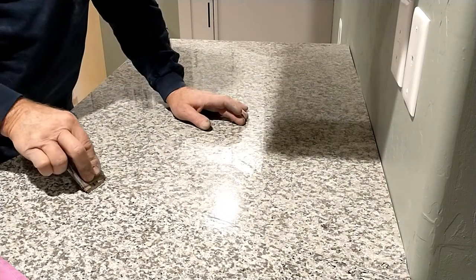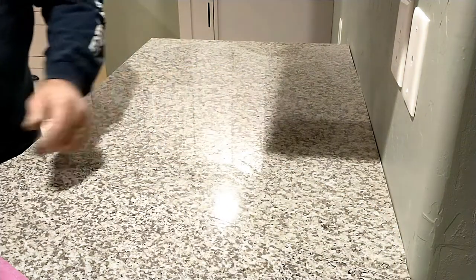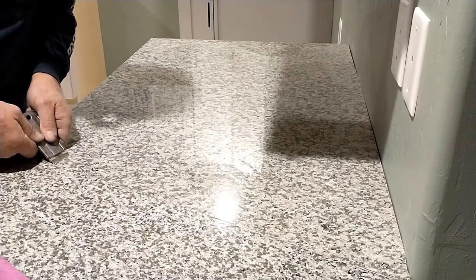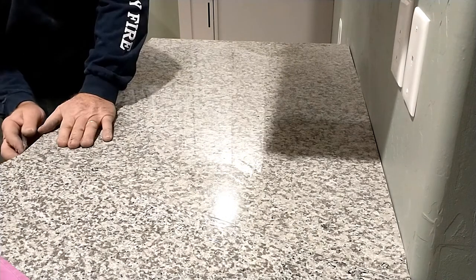You can run along the side again and clean up any residue. A lacquer thinner can cut this and clean it up a little bit, but only to a point — as it gets harder and harder it becomes impervious to that. Scrape off all you can because then you're down to possibly just sanding. Don't forget the front of your top.